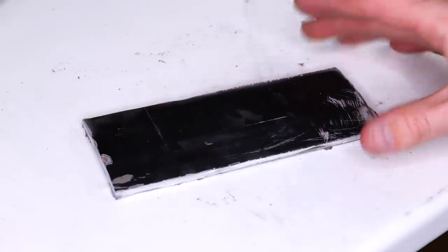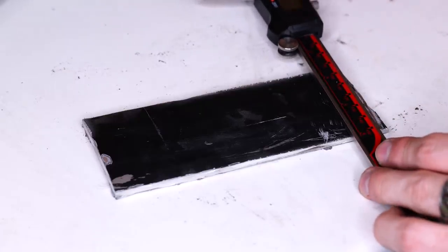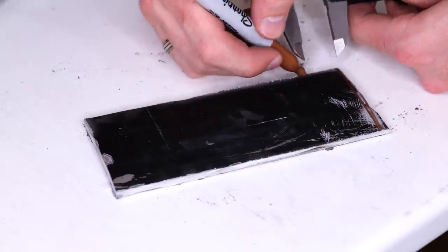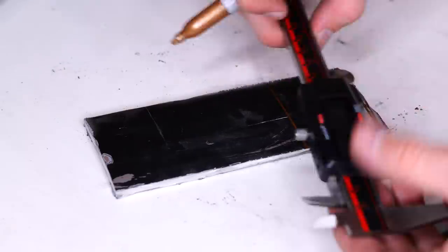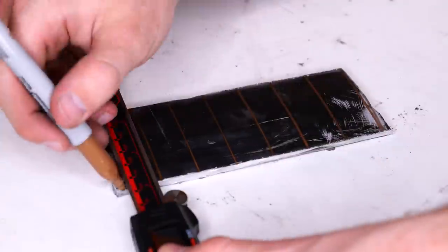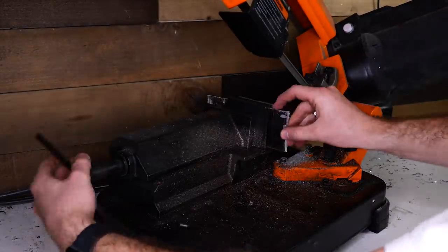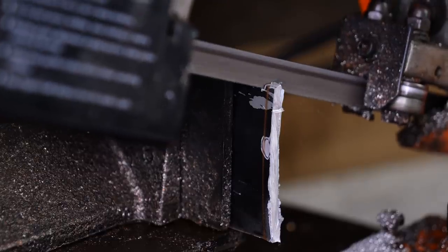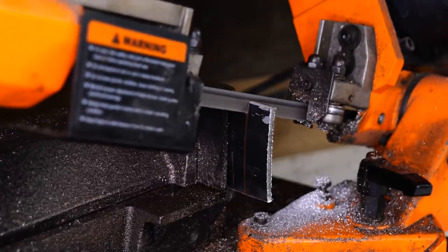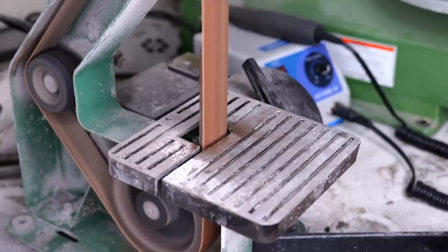So far so good. I'm going to use my Sharpie again to draw some lines on here. I'll measure them out precisely how I want them — that'll be a guide for me to cut out each individual pendant. And then I'll use my metal bandsaw to do the cutting. Now the saw leaves a really rough finish, so I'm going to quickly take it over to my belt sander and just clean it up a little bit.